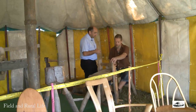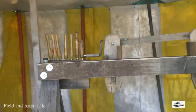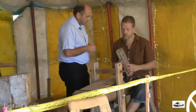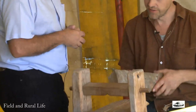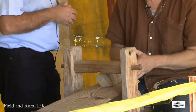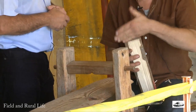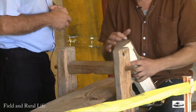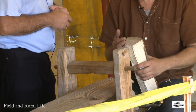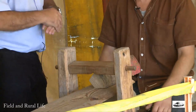What's this? This is a shaving horse. I've just split this piece of wood out of a log and I'm just about to shave it down into a sort of rough cylinder, and that will go on to be — well today, because it's a show, it's been made into a rounder's bat. But if I was at home, I'd make that smaller in section and turn spindles or legs or whatever. And then we can produce that on that item there — do all the turning on the lathe.